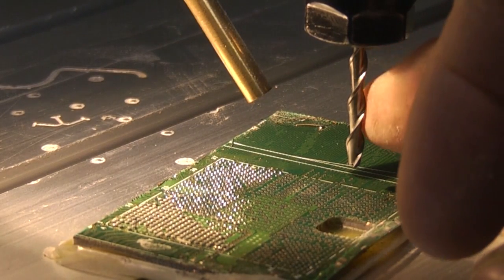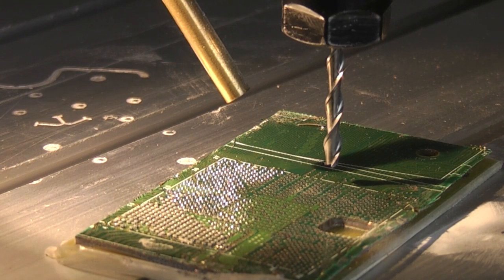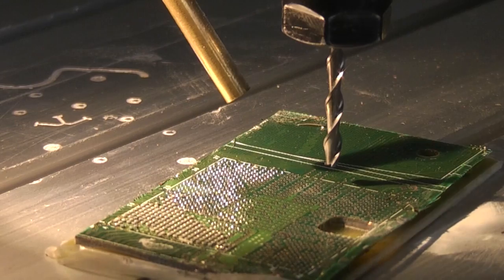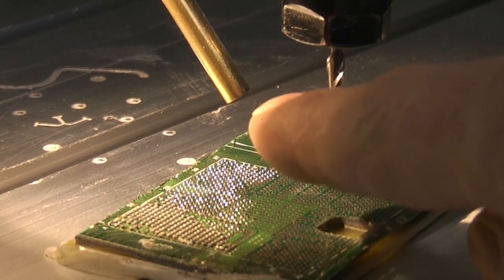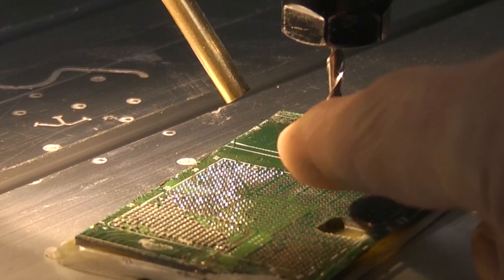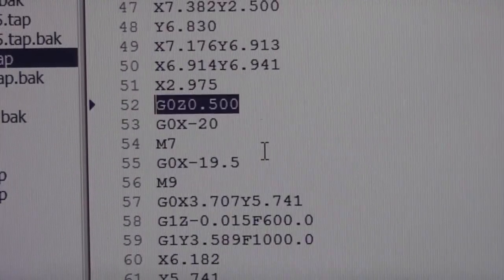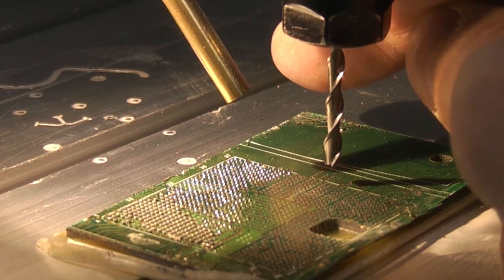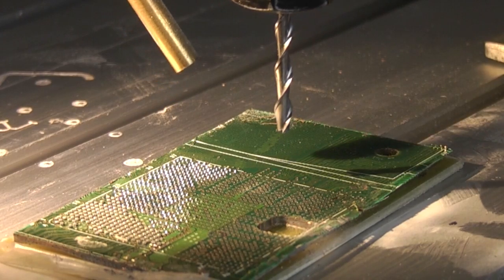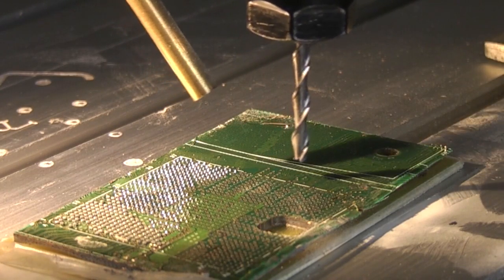I also wanted to make the tool clear away from the pocket before taking the photo. The workaround was fairly simple - I took the G-code that came out of the CAM tool, and because I knew there would always be a code in there to lift up to half a millimetre above the surface at the end of every path (to avoid wasting time going too high), it would always produce a G0 0.5 command to lift the tool. So I could use a bulk search and replace to change that to: lift, then move away, take the photo, then move back again.